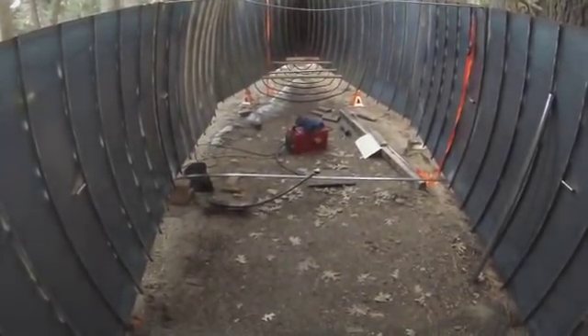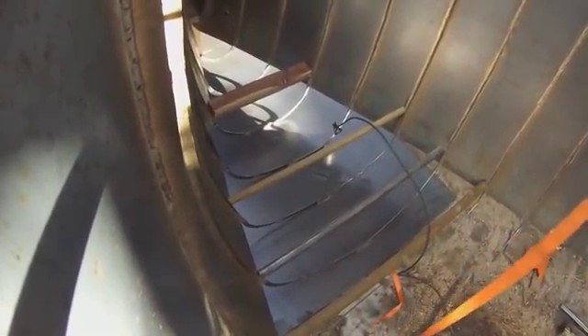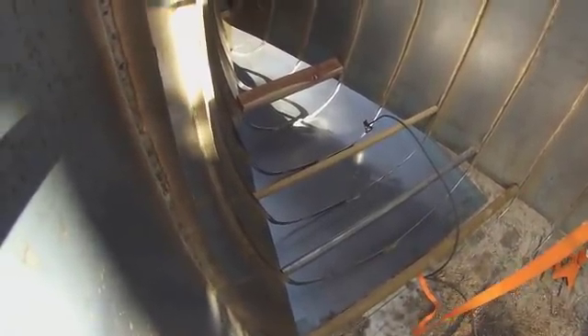This is the end of day 13. I've got the first floor piece on, welded in the middle on the first three ribs. I messed up on one rib but that's okay — it's great to have a hot metal glue gun because you can just add more metal. I'm cutting off the excess on the outside because it'll be harder to bend with it on. Little by little I'm reducing the gaps between the bottom and the ribs. This whole rib used to have a gap and now this part is at least touching. As I work along the gap will close further.